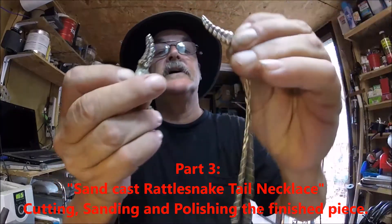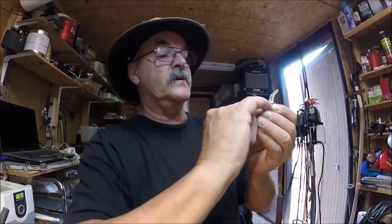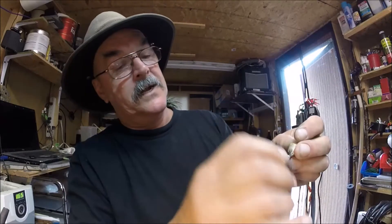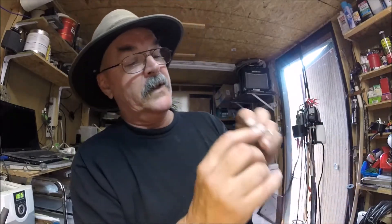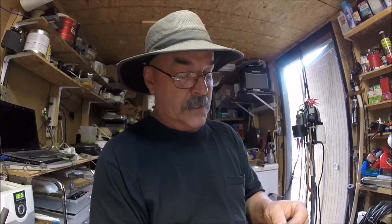What we need to do now is clean it up a little bit more. I go over it with some fine sandpaper, I'm gonna cut it out right here on the line. You can see the sides better on that line. I use my little saw and I'll cut it out, file it, go along the edge here where that seam was — I'll take my little files or sandpaper and do the final polish.